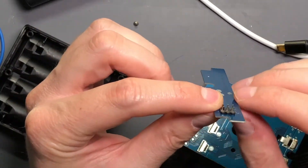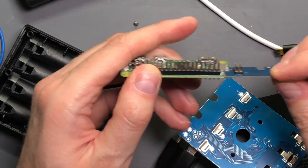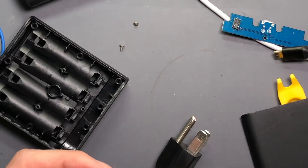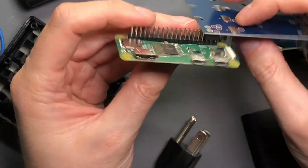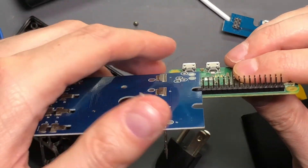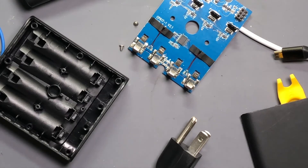I feel like they just shortened these pins. Comparing them to full-length pins from a Raspberry Pi header, you can see how much shorter they are — they really cropped those pins down to fit. If I were to grab this and press these six pins in, I think they have the same pitch. Yeah, they fit all the way down. You can see there's a little bit of pin showing, so the replacement might be slightly too long, but clearly the current ones are too short. Soldering iron is warming up — I didn't plug it in. There we go.